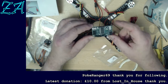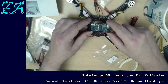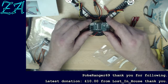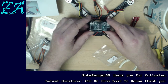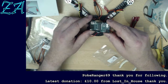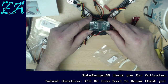their relative direction. So let's say, and I make this up, this one senses it doing that, this one senses it doing that, and this one senses it doing that. So you get the, they call it 6 axes of movement, but 3 axes of movement. And so if you get a wind gust that makes it do this, so I didn't tell it to do that, but the wind does that, the gyro goes, hey, it's moved, and tells the chip, which makes these two spin faster and stabilize it.